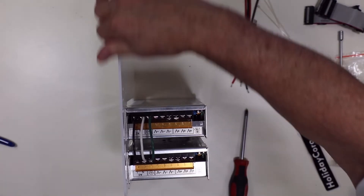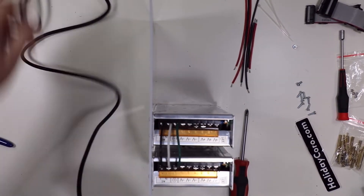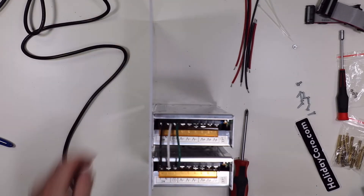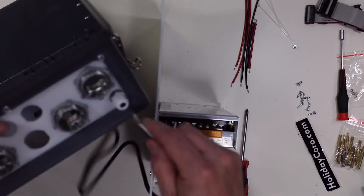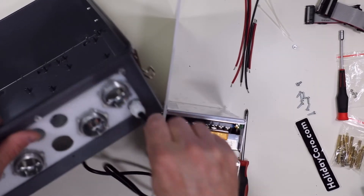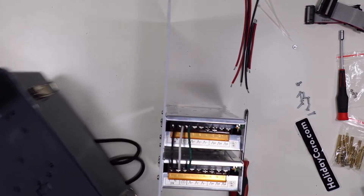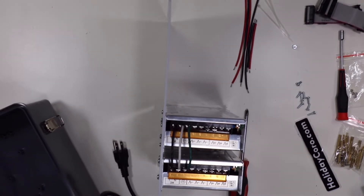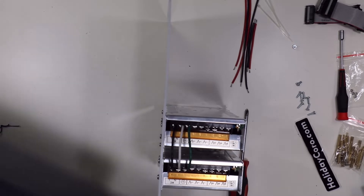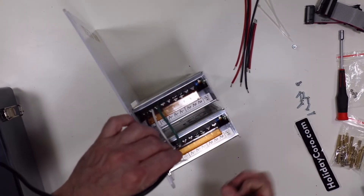The power cable is going to come in through the bottom of this board and then come out on the top. What we want to first do is run that cable through our enclosure. We have a power gland on the enclosure, and we're simply going to loosen this up and push the cable through. If you don't put it through at the beginning, you'll have some problems later. So we've run the cable through and we're now going to hook it up to the power supply, putting together both sets of wires.